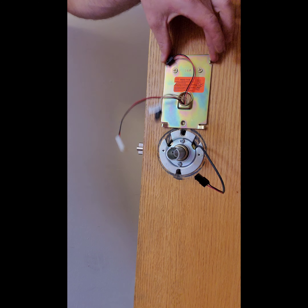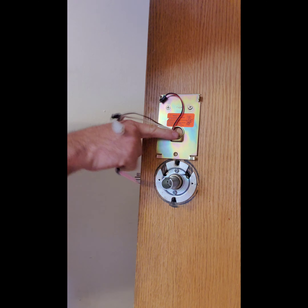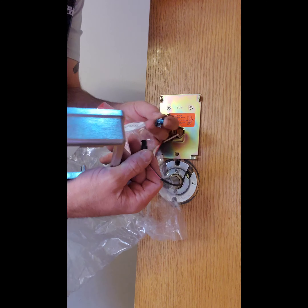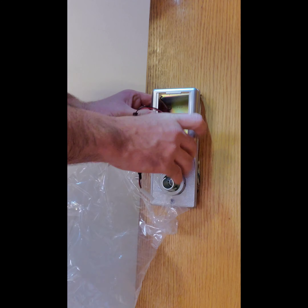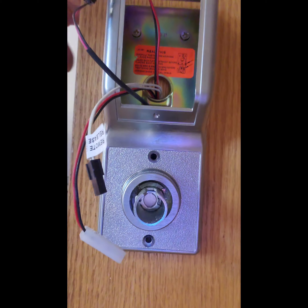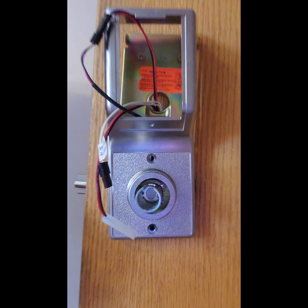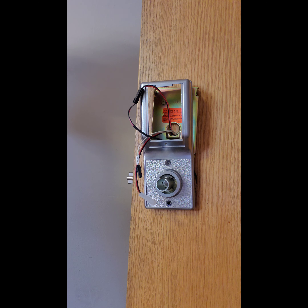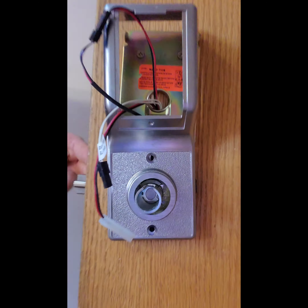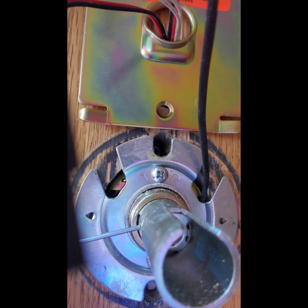We have attached the plate that attaches to the chassis — it has a portion that says top and bottom, and there will be pan head screws that go along with that. Next we have installed the mounting plate above that — the secondary square plate that is mounted to the door. However, I highly recommend that you do not tighten these two screws. You will need some wiggle room later when you need to install the other screws. That plastic washer is the spacer — if you need to install on a thinner style door, that's what those are for.